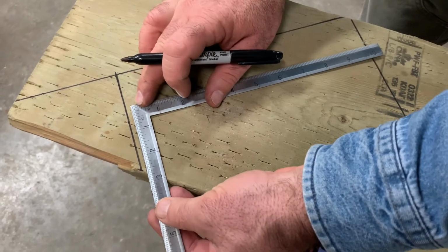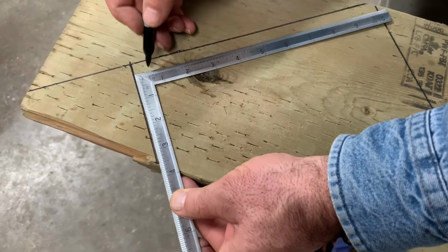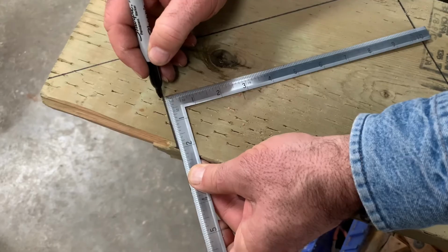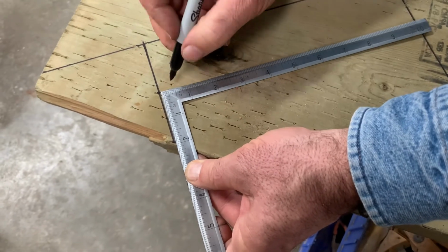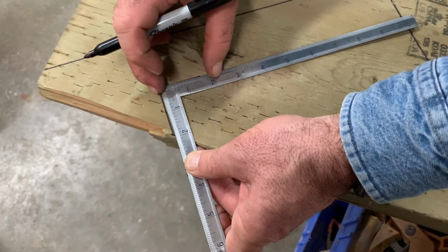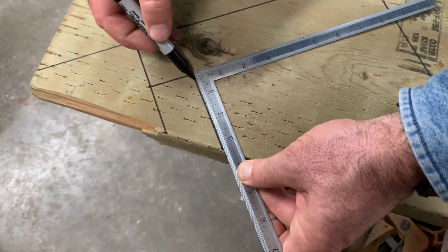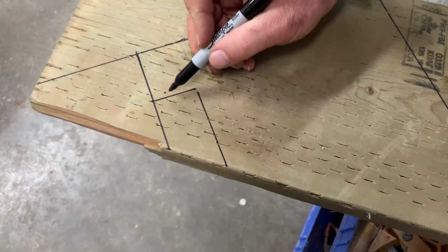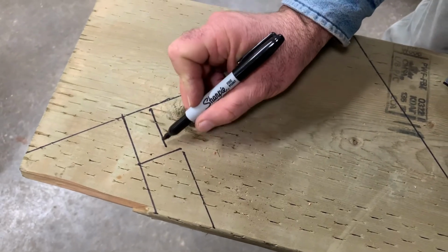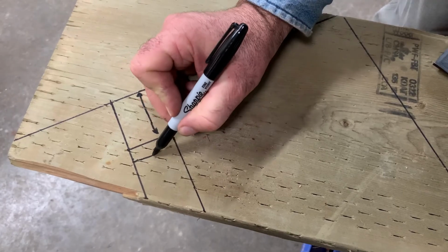Actually, we don't have the whole 3.5 inches in the stringer, because if we do, we don't really have a lot of wood up top there. Even a small notch, say a couple of inches wide, will do us just fine, and 1.5 inches in depth, because that's the thickness of a 2x4, and then we would cut this here. We could make this even smaller, actually. Looking at it right now, this seems a bit narrow here, a bit prone to breaking off, so maybe we would put it down here.